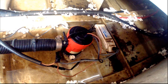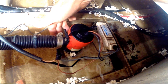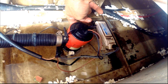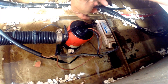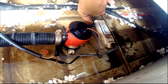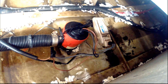So what's going on here is we've got a very similar circuit to the one I showed you in the wiring diagram. This one's actually got a little welded plate. The first part to installing it is having something to attach it to — in an aluminium boat like this you can't just screw it into the hull because it's a thin hull and you're going to go straight through. But you do want it down in the bilge, right down where it's going to get to the lowest point, which is generally the back of the boat near the keel. The problem with this setup is when I got on this boat, the bilge pump was actually running and I don't know how long it's been running for — that's because the float switch is in deeper water than the pump itself. So it was in a situation where the float switch was up and staying up but the pump itself wasn't actually pumping any water.